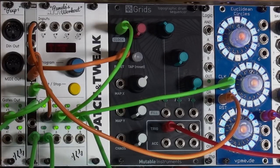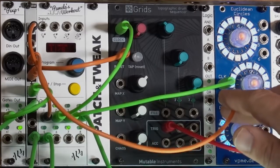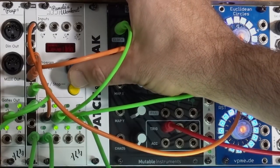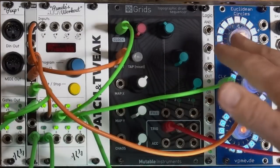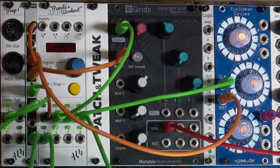So what I need is a way of either moving the reset just a little bit ahead of the clock, or delaying the clock just a little bit behind the reset. I tried some tricks with changing the timing of the reset to be a little earlier, hoping it would come out just a smidge ahead of the downbeat. The problem is that the phase is set in terms of percentage — 100 divisions — and when you're sending out a pulse only every 8 or 16 beats, even 1% is a long delay. I was chasing my tail trying to find phase settings that would work, but they were all earlier in time compared to everything else in the case.